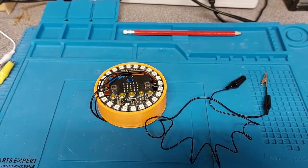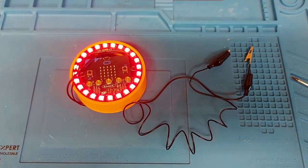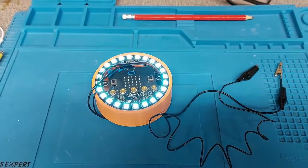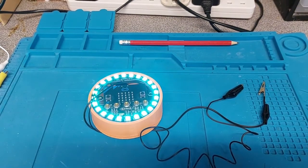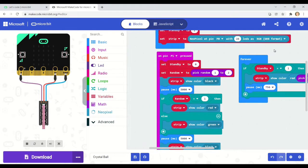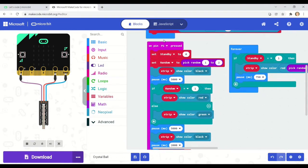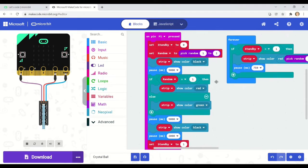In this case it's a no, because it's red. The code for this — if you've got a halo, they are so much fun — is really simple. As you can see on the screen, it comes in two parts. The forever loop just cycles through random colours while in standby mode, and that forever loop is interrupted when pin one — the coin switch — is activated. It then goes through its pauses, selects a random number like tossing a coin: if it's heads it's red, if it's tails it's green.